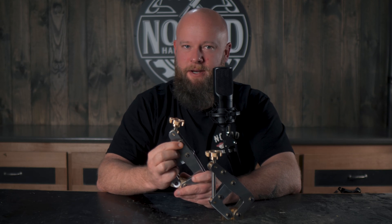This hole is supposed to be off center — I moved it up a little as I was worried that the standoff I put there might interfere with the pivoting action later down the track. Last step for these: I'll give them a brighten up on the grinder for a bit of a brushed look and they can be set aside.